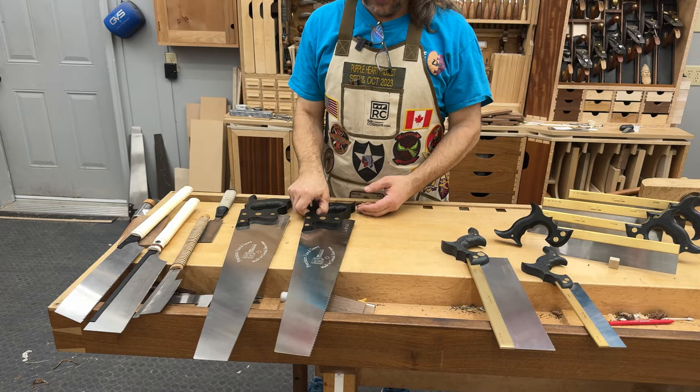A panel saw or hand saw has a little thicker blade — these are actually 32 thousandths of an inch thick. We wanted to make it so that it didn't wobble quite so much. We're dealing with a market that hasn't had a lot of training in using hand saws, mostly the hobby industry, so I thought that was a good trade-off. It is a little bit heavier, but it really sails through the wood nicely. These come in both crosscut and rip, and with no back on there, you can go all the way through.